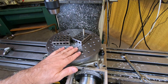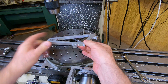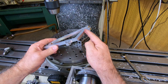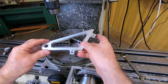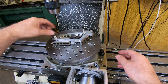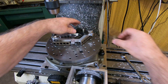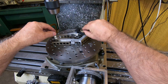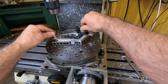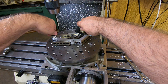Out of the machine now, I've got the rotary table set up. The reason I'm going to use the rotary table to machine these lugs off is because it's going to allow me to easily align these surfaces with the X and Y axes, so I can just machine along there, cut the lug off, and get it nice and flush with these existing surfaces. I'm just going to put the part up here on these blocks, in an almost ad hoc way — I'm not really being too fussy about it. I'll put a clamp over on this side. Really all I care about at this stage is making sure I've got clearance with my clamp and that I'm not going to hit my block with my end mill.